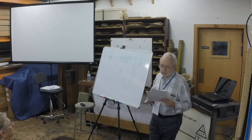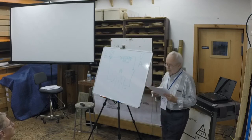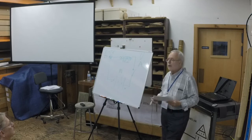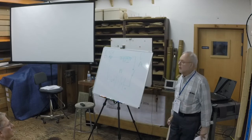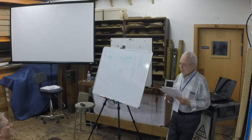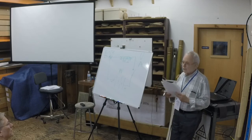If the same rectifier supplies the combination action, you need to add another, say, ½ amp per draw knob or stop tablet. And you have to assume that someone might just play that big chord while pressing a piston. And don't forget the stop action magnets, many of which are going to be on. So add all that stuff up and then choose the next larger rectifier.